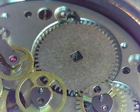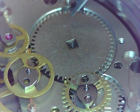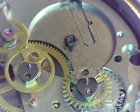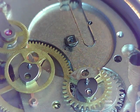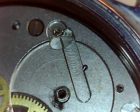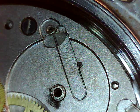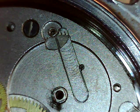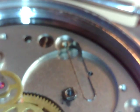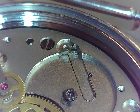I had already loosened that, that's why it appeared to be loose — because it was. There's our ratchet wheel. And there's the click spring; it's a little different than what we're used to. If you go to touch that, it's going to come springing out of there pretty good. So unless you want that out of there, you're going to put a finger on it, a pair of tweezers — you're going to hold onto that somehow to keep it from flying out. So there's our click spring, and it is functioning.